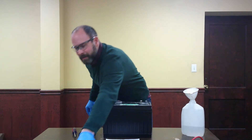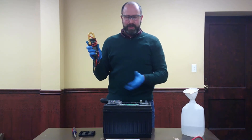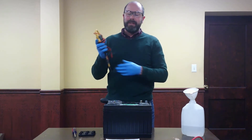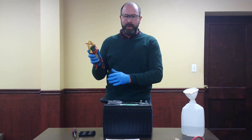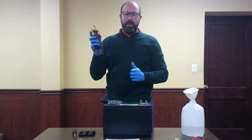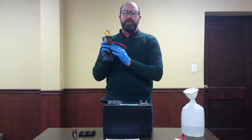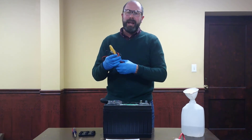Another device you might want to use is just a voltmeter. You can check and see — this is a 12-volt battery — let's see where the voltage actually sits. Run it a little while and see how much it's dropped. That tells us quite a bit. Sometimes we'll even run a piece of equipment with the voltmeter hooked up and just watch the voltage drop as we run it. That's even more effective because when your scrubber's running, we can check voltage in real world conditions. That's a really effective method of seeing whether these batteries are okay or not.